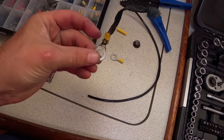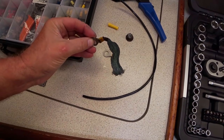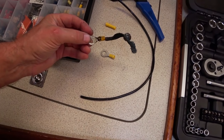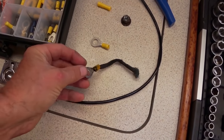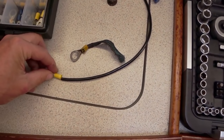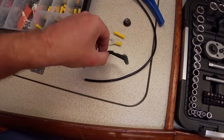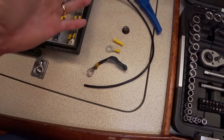This is the part of the strap that attaches to the body of the engine, and I'm not sure if you can see, but it is highly corroded, and the reason for that was because the expansion tank of the cooling system overflowed quite a lot because of the position it was originally in. I've since moved it, and it's just corroded through this. So what I'm going to do is get this wire, attach it to here, and then undo the zip tie that is holding the rest of this neatly packaged away, and reattach the other end of this into here, and that will reattach that connection.